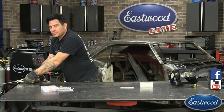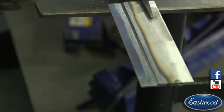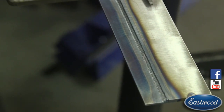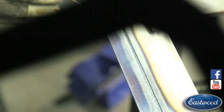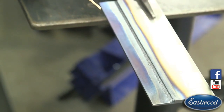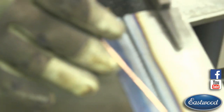And it just takes a second because we're going from a really dark lens back to a normal one, so it just takes a few seconds. So you can see that edge right here along the top where we're pretty much straight. I mean, we didn't touch it at all. We're down in the bottom. So like I said, I was adding my filler. I was favoring this base piece a little more, but when you added it in, it would actually pull up into our top layer here and put the two of them together. Now the other thing, you got that pretty good? So we're getting a little bit closer so you guys can see that straight edge along the top there, that top layer.